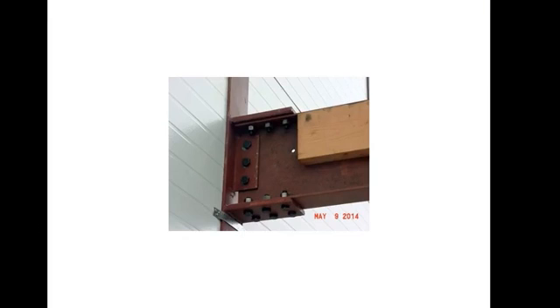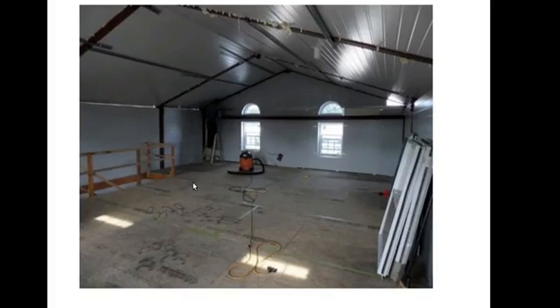This is a connection from floor to wall column — very, very strong. Here's the third floor of this residence. You see how the foam is coming out. Between the rafter beam and the SIP panel we inject foam into that whole cavity, basically by drilling holes and puncturing in with a wand and filling the entire cavity between SIP to steel. There's no air infiltration through the panel because it's a metal face panel, and once you foam this joint and tape it there's no air infiltration to speak of — you have complete control over air movement.